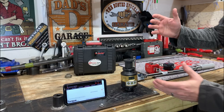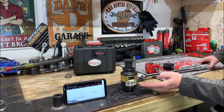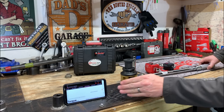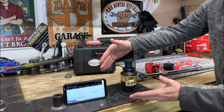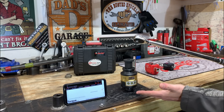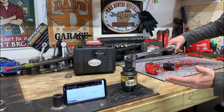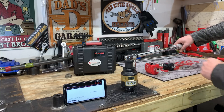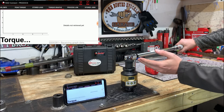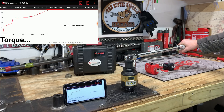We're going to start things off with the tower of torque. We have our smart socket connected via Bluetooth to a digital device that'll allow us to graph and keep all of our information. If we had a job to do, we could upload that information later to that job, verifying how many times and what we torqued our fasteners to. So we have a manual clicker torque wrench here and we're going to click this to 100 foot-pounds. This is going to get us a baseline for our tower of torque.